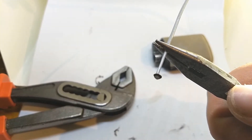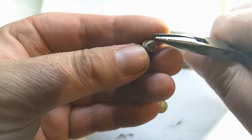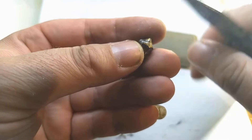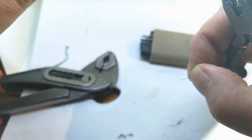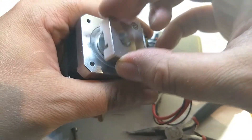And here it is. From the outside I cleaned the nozzle with a brass brush and also sent some stuck filament down. Before assembling the extruder I used some hairs of the brush to clean up the 0.4 millimeter hole in the nozzle. After checking if I can look through it, it's time for assembling the extruder.